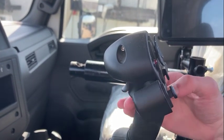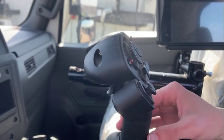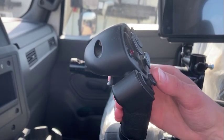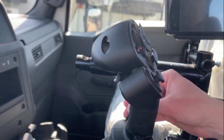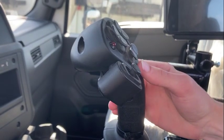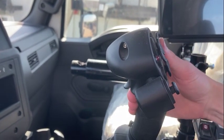If you have your conveyor at 50% and you push your stick to 10%, the beaters will engage, the floor will run at 10%, and the conveyor will run at 50%. So without using the trigger in the freestyle feeding mode, you have complete control of your chain speeds. But to get back to zero, you must pull to the stop.